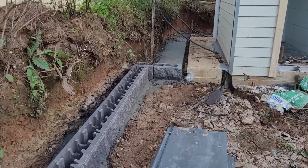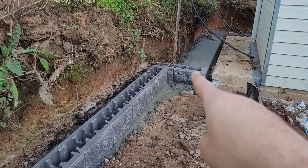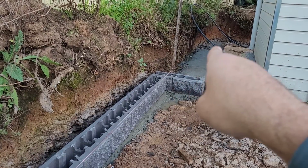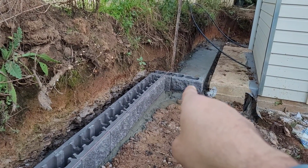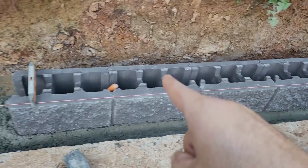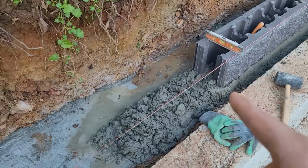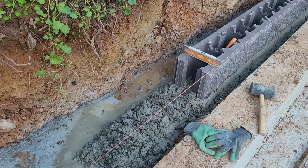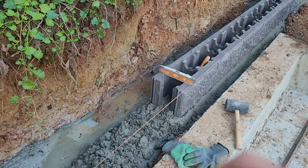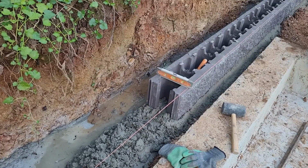We're continuing to install the blocks, and I first installed the corner blocks in that line because I need exactly the line of the concrete, and then back continuing to set the line and install the blocks on top of the concrete mix because it's about 35 millimeter. I need the concrete. Mortar is a bit softer and going down.